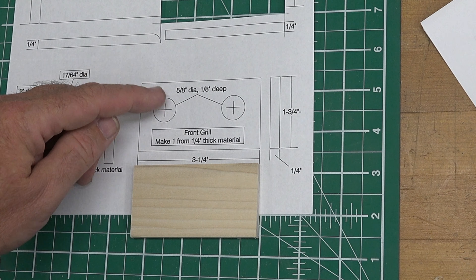The chassis is one of the simplest pieces in this entire build. It's half-inch thick, three inches wide, nine and a quarter inches long — I've cut a piece of pine to the dimensions on the plans. I've scaled off the drawings and got three holes here on each side. I've marked them on the edges of our chassis, given myself a little center punch at each one, and then taken it over to the drill press to drill a quarter-inch diameter hole, one inch deep, at each one of those marks.